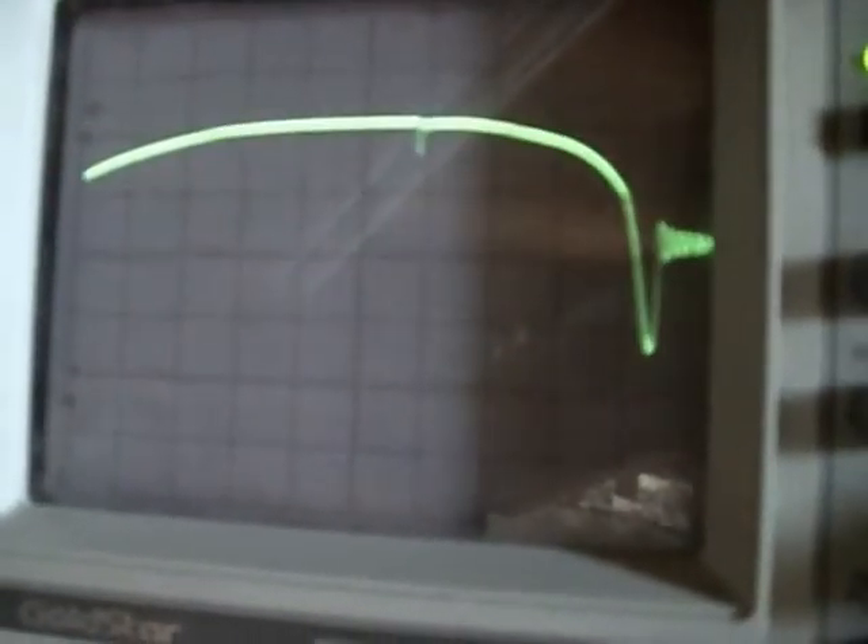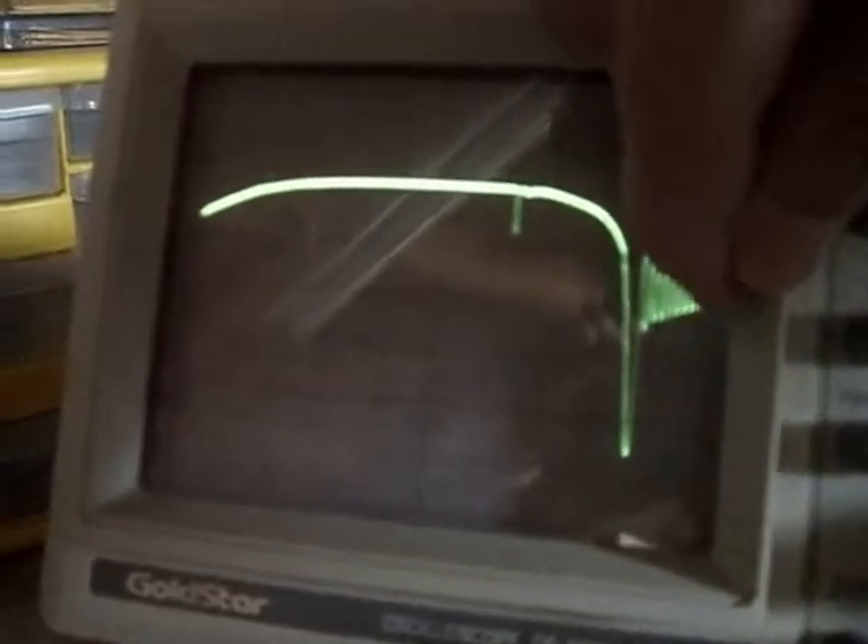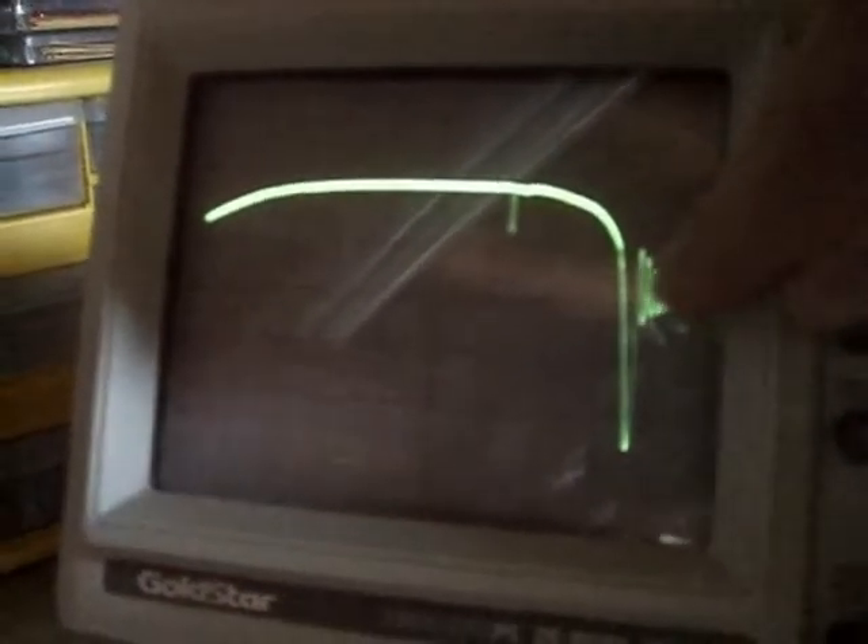This is with some resistance right here, where you can see that chaos goes away. You get this spike and then you get this nice ringing. Any information out there about this ringing taking away from this spike is misinformation, because you got the on pulse and then you got the spike that goes back to the battery. This right here only cancels itself out as far as battery charging afterwards — that does not equalize the spike. This spike does contribute to charge on the battery.